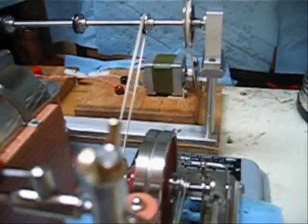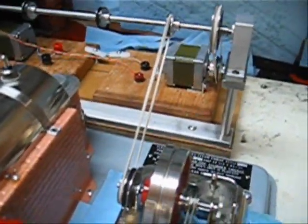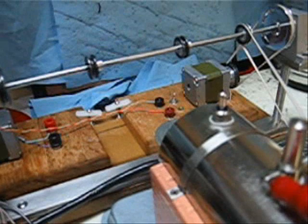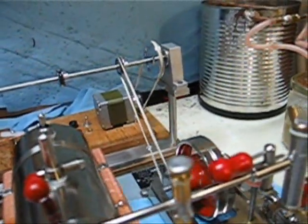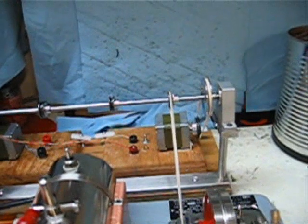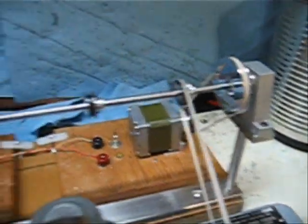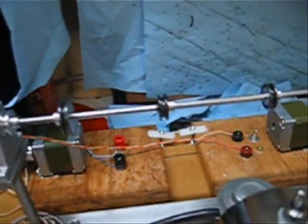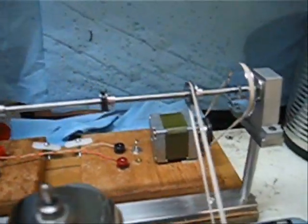As you can see, the Jensen's hardly making an effort with the generator at all. I'll just disconnect our load — there, going a little bit better. It does work a little bit better without the line shaft at all, so it is imposing a bit of drag. And of course the gearing isn't quite optimal. What I need to do is mount a couple of Jensen two-step pulleys along that shaft, then I'll be able to change my gear ratios a bit.